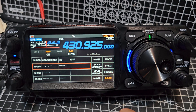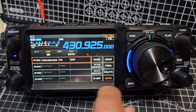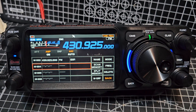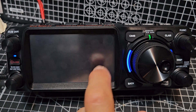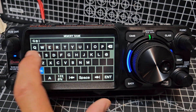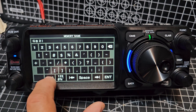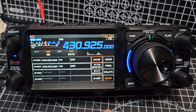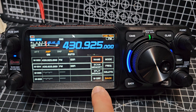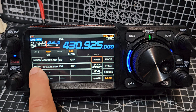It's giving you the chance to further change the settings you've already applied. I want to name one. We haven't saved it yet, so we need to go to where we want it to be first, then press and hold the VM again — it puts it in there. This time we're going to do name. We can go G — the numbers at the bottom — 3, A, B, C again, F, I. Enter. It still gives you the chance to change the mode, delete it, split memories, and select a different memory group.